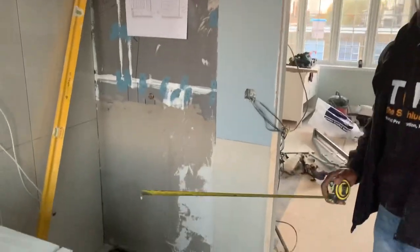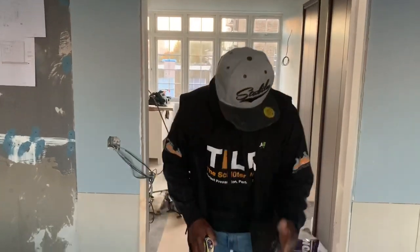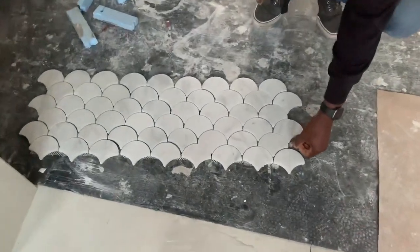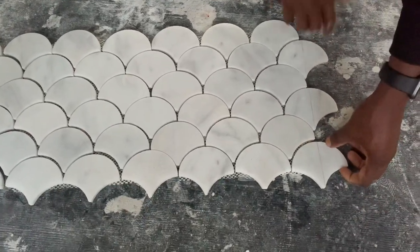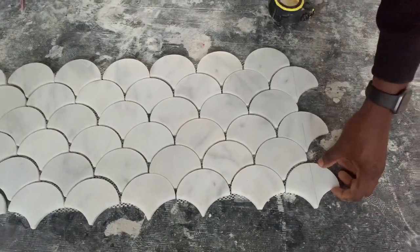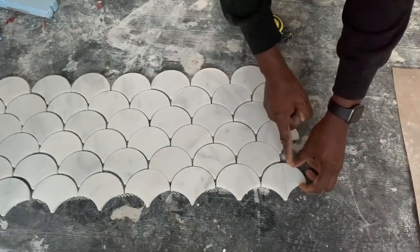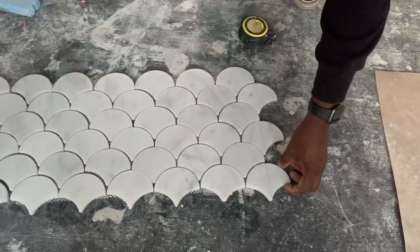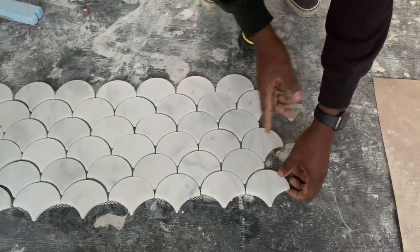And what we've done, when you're using this tile, there's a trick to it, right? Pretty much, let me show you. If you get this tile, the layout, and it cuts here, on that line here, you end up having to put a little piece in. So the trick about this tile, what you really want to work out for your feature wall, is not passing half. You want it to be inside half. So you have either a straight cut that goes up against your tile, but if any of it passes this side, you have to start putting in a little piece.